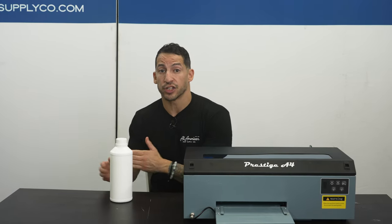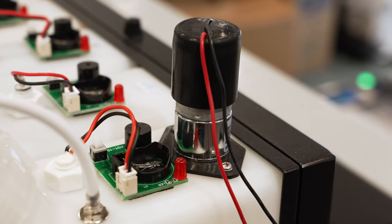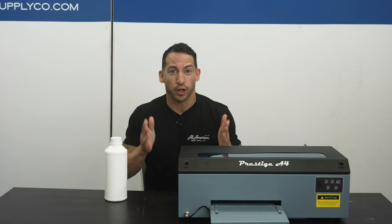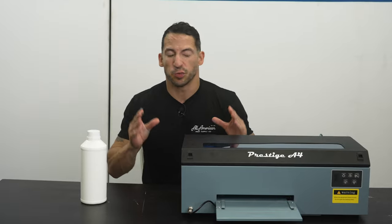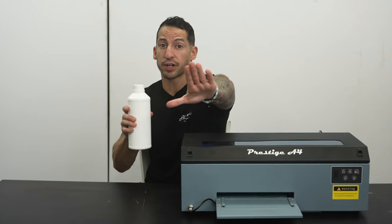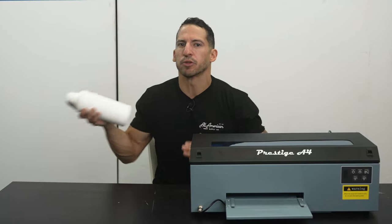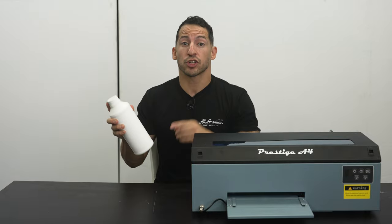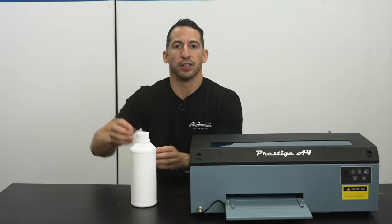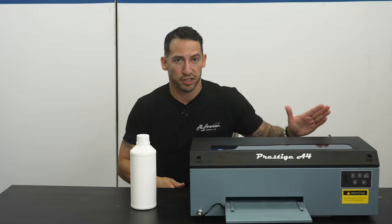As far as agitation, these machines are equipped with a motorized agitating stirring straw, which will continuously stimulate the ink, further preventing any separation. We don't want anything clogging our printhead. When loading your white ink before production, agitate the heck out of the bottle until you can hear the bubbles beginning to develop. If you're ready to start production, crack the lid just a little and begin to let it aerate — this will help prevent separation and give you the most fluid white ink possible.